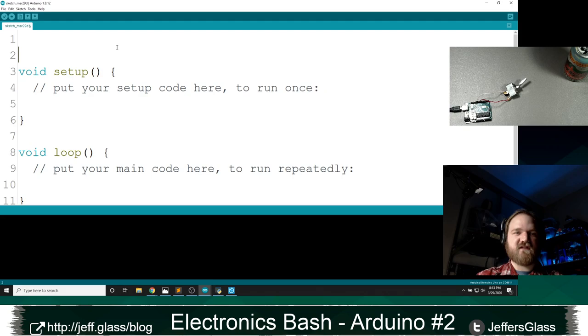All right? So let's see what else I had on the to-do list for tonight. We looked at serial, we looked at digital input. Oh, let's talk about serial the other way, right? Let's talk about doing serial communication from the computer to the Arduino. I think that will be quite interesting. Let's start a new piece of code. There we go. So like before, I'm going to start by doing Serial.begin(115200). That's just my preferred value. This could be 9600, right?